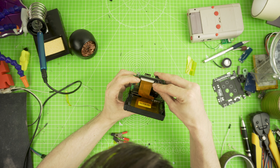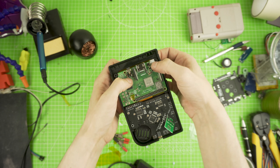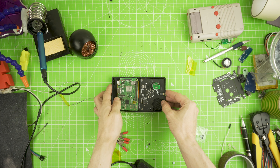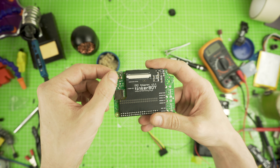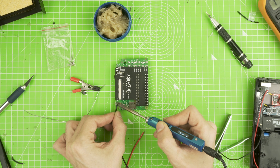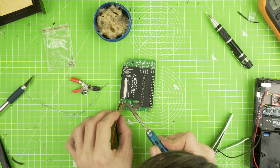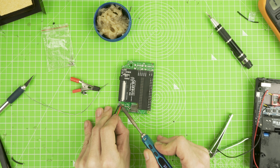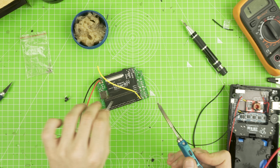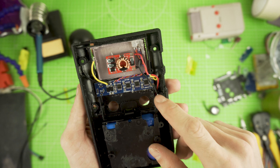Let's make a test fit. Carefully connect the display ribbon cable into our DPI adapter and place it on top of the display. Everything should fit perfectly. Once we know everything is fine, let's start wiring it up. We need power for both our DPI and Pi, so let's prepare four 24-gauge cables by tinning them. Solder one set on the Pi power-in pins — top pin is negative and the bottom is positive. Don't mix these if you don't want a $60 brick. Solder the other two on the DPI adapter as well, and we are done with wiring. This can go directly in the case, finishing our front part of the build.